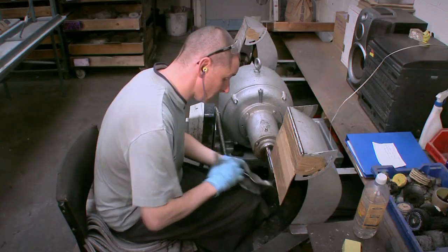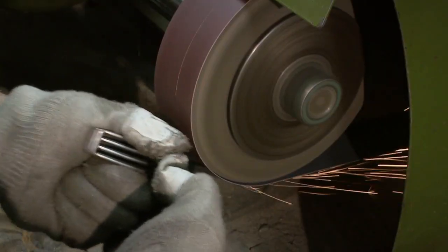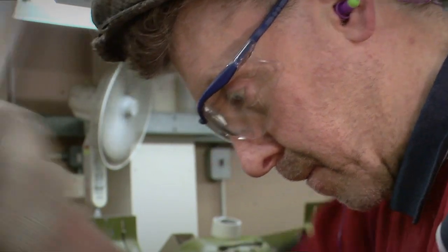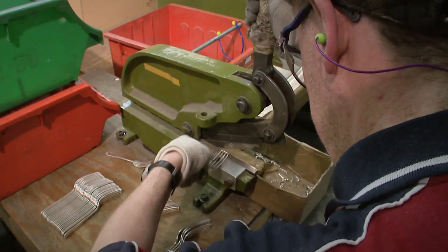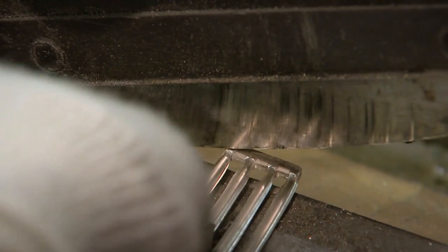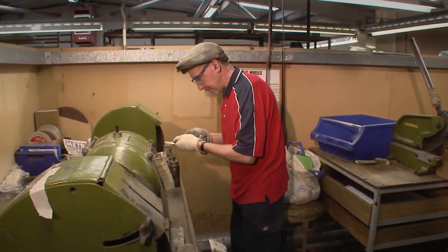But all this rough treatment must now be polished away by the knee polisher. On the other side of the polishing room, a fork handle is under attack. The forks come out of their presses with a protective strip called a gate across the top — well, you couldn't stab a jelly with that — and the gate is removed so the prongs can be individually sharpened. Forking, or furcating, from the Latin word furca, is the act of dividing something into branches. This chap has been furcating in his cloth cap for over 20 years and is one of the finest furcaters in the business.